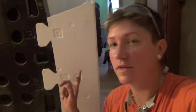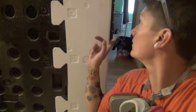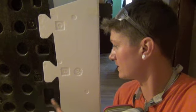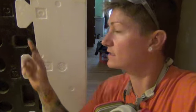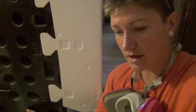Next is the tub. This tub came with this little piece that said do not discard, and it's a good thing I didn't because it actually keeps or maintains an even space from this bottom to the outside. We need to make sure we glue. This is glued. The tape's holding on right now till it dries. And we're gonna also put some adhesive on the floor when we set this. Hopefully the plumbing matches up perfect and we don't have to mess with it.